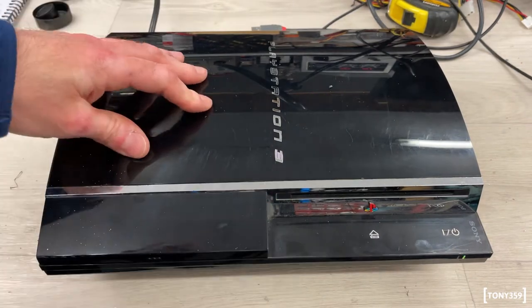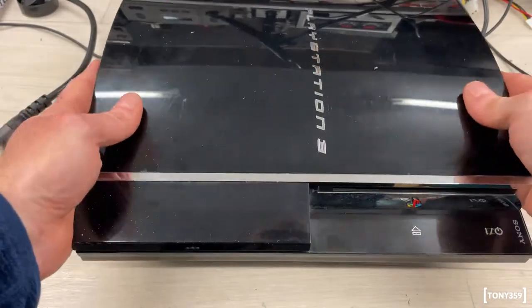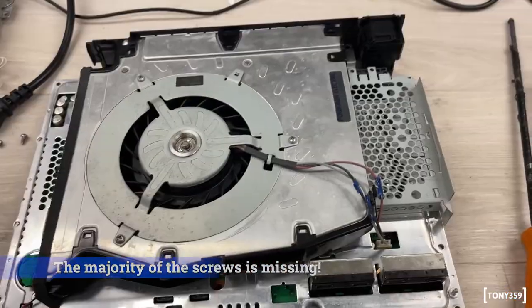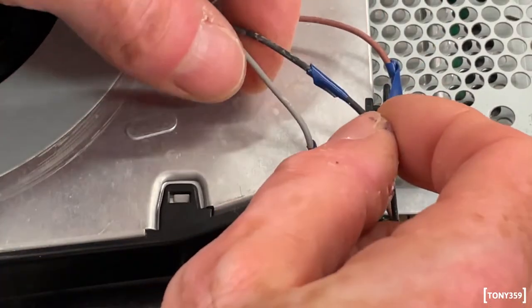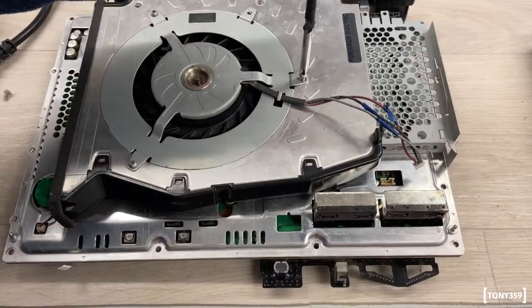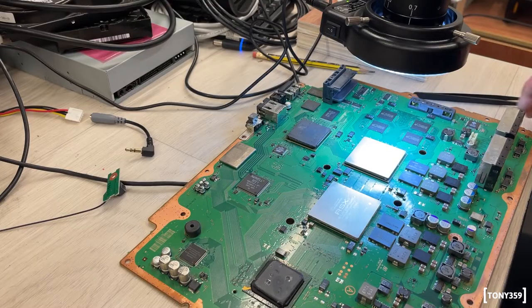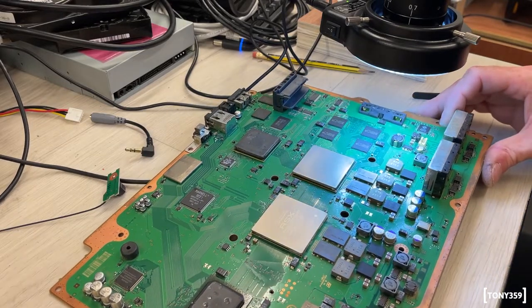First of all, let's try and power it up. Got power supply on, I have a green light here. And it immediately switches itself off. I'm wondering what happened here. There is some electrical tape - probably the cable was damaged. The connector is okay. Wondering whether the fan is working or not. Let's take a look under the microscope, as maybe I found what the problem is. Because obviously there was an issue with the fan on this board.